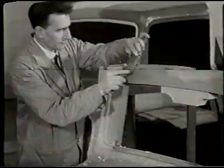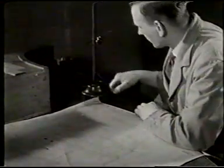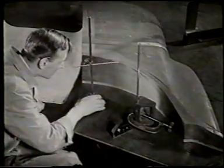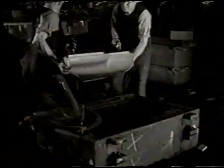The finished design first takes shape in wood under the skillful eye and hand of the pattern maker. And from this pattern, every detail of which must be worked out accurately to a fraction of an inch, the pressed die is evolved. This is cast in a sand mold made from the pattern, which leaves dimensional allowances for machining to the final shape.